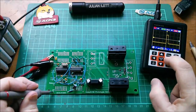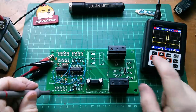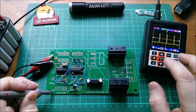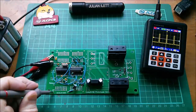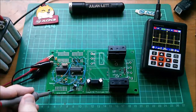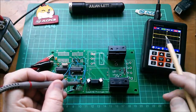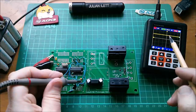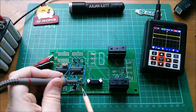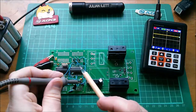Just poke it in that hole — and there we've got a 23.7-volt swing, our 10% pulse width. Ten percent corresponds to a 6-amp charge, which is about 1,300-something watts at 230 volts. The voltage at the top of this waveform is measured with the peak follower, giving a static DC voltage. It's measuring just over 10 volts because there are two diode drops — one in the emitter follower and one in the 1N4148.